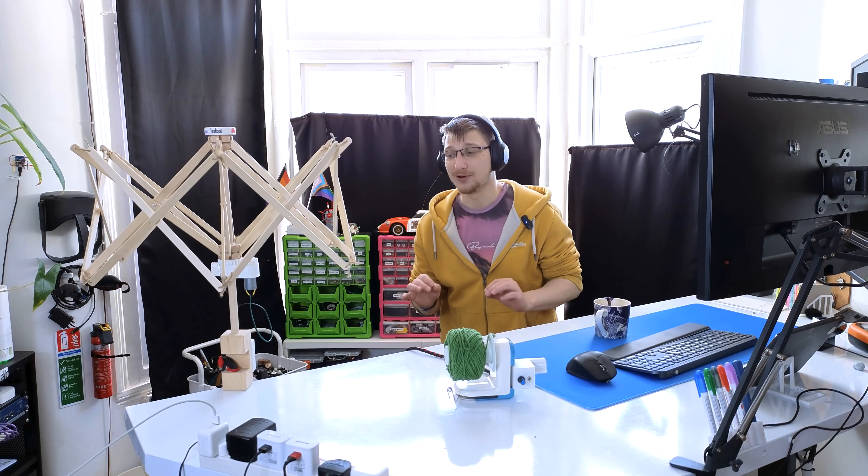I'm super proud of this for no reason. When I was designing and printing these threads — printing threads always sounds great in theory but it never works in practice. There's always over-extruded plastic that won't let you fit things together the way you want. The solution? Get yourself a tapping set. I've gone through way too much of my life without one. They make things so much easier and they've changed the way I'm going to design things probably forever.